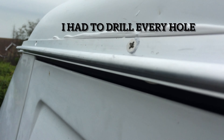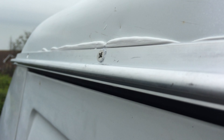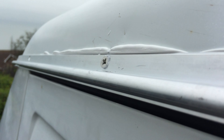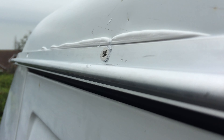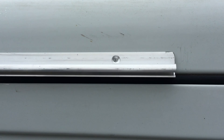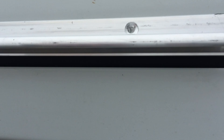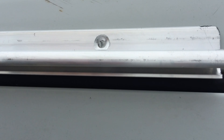That one wasn't screwing well — I had to pre-drill it. I think using the impact driver it's a bit too high speed; it's difficult. If you use a drill and go slower it bites in better. But that's hit something and the screw's stripped, probably the frame line. So I'm going to pre-drill this one just to get it seated in. I'll just try the others again without pre-drilling, with the self-drilling screws.